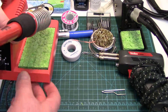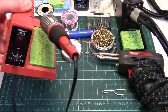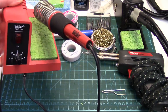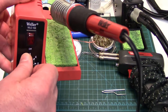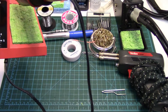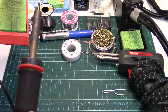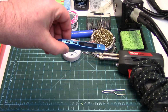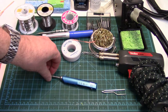Last up is one that a lot of people have probably seen in hobby shops — this is the Weller WLC 100. It's a 40 watt so it's pretty limiting. You might get 12 gauge with it, but 14 gauge is pretty much where they max out. It does have — this isn't heat control, it's more or less a wattage control, kind of like the two-trigger gun only you've got a variable rheostat controlling the wattage. Not a bad little unit for the price. However, for not much more you could get one of these or even a clone T12 soldering station — I talk about all that in the soldering page on my site.